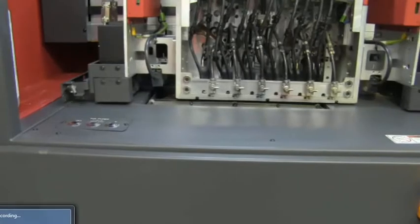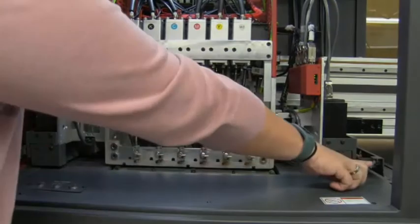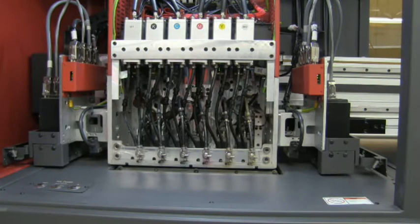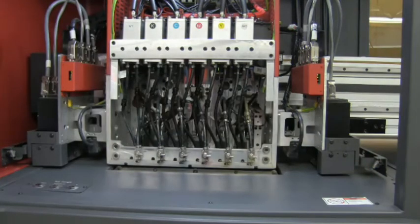Also on the carriage, you'll see the leading and trailing sides. We have the first of two wrinkle detect systems. If you have a buckle in your material — maybe your roll was running skewed or you're running a piece of plywood with frayed edges — it will come into contact with the material before causing any damage to your lamps or jets. It acts like an e-stop but spares you any damage to your carriage.